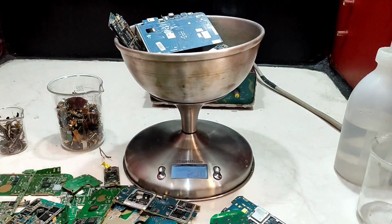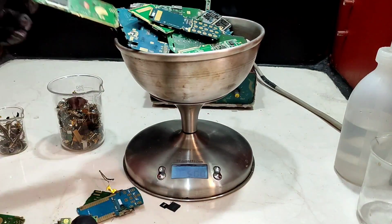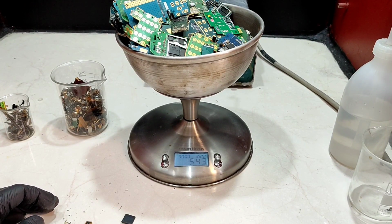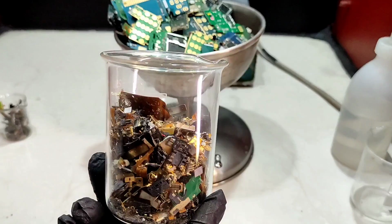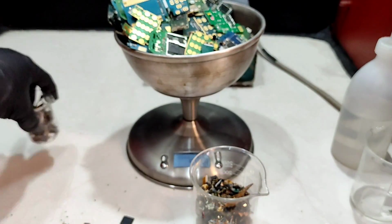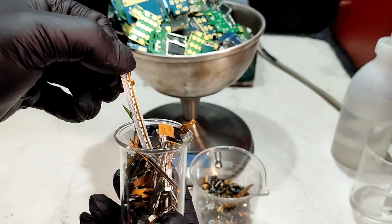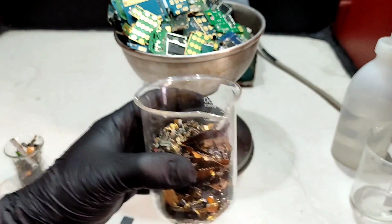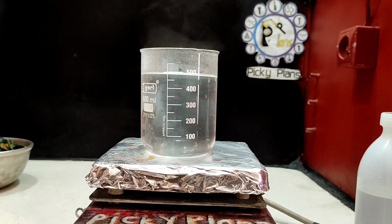It took about 4 hours to scrap 3 kilograms of cell phones. These are mostly old ones referring to the year 2006, which yielded 540 grams of PCB boards. I've also collected all gold-plated pins like SIM card and memory card pins in another batch. Other components like LCD flat ribbons, which contain some gold, have been sorted. I did the same to the cameras based on the way of recovery, in this case burning cables and cameras.